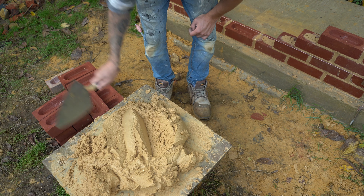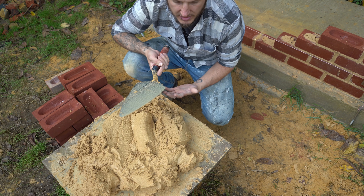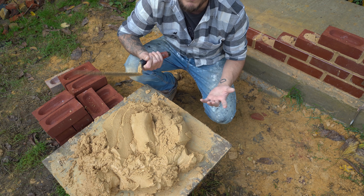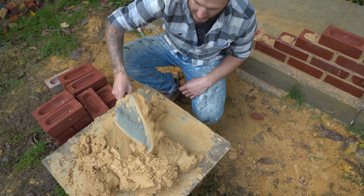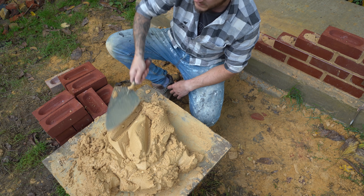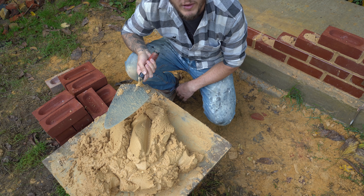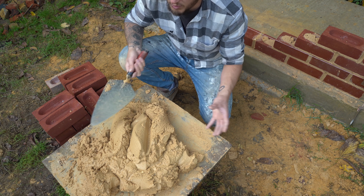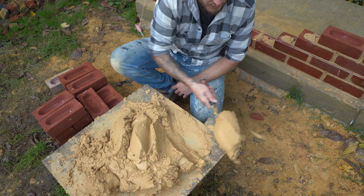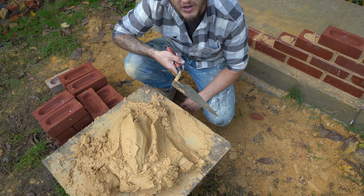You just slap it in and pick it up. That is the more advanced way to pick the mortar up and get it on your trowel — either on the edge or in the middle, depending on what you're doing. On the edge is probably the easiest. From here on out I'll probably be doing that all the time rather than showing you the loaf-of-bread roll or whatever you call it. Now that we've said that, let's get on the line.